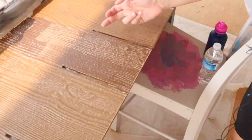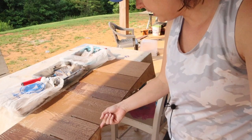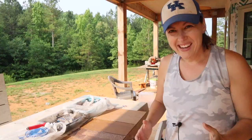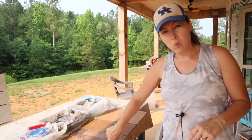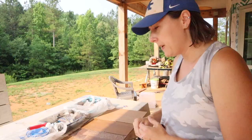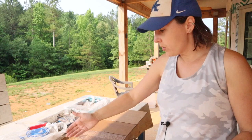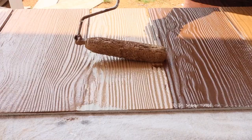When I first started, we did not paint inside the cracks. You can kind of tell it's brown in between there — you really have to get in there with a brush, and we did not do that at first. The first two sides are pretty white in those cracks. On the front side, because it's more visible and gets the afternoon sun, I was really noticing a lot of white popping out from those cracks, which I did not like. So while we had the scaffolding up, I went up with a brush and touched up the cracks, but that made a stripe, and then I had to touch up the brushing. It was kind of a pain. So with this last batch, we're going in with the brush first to get it a little bit darker so there's not that big pop of white.